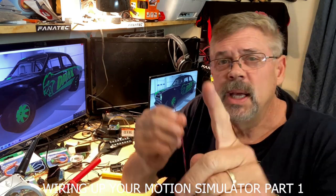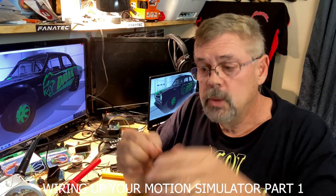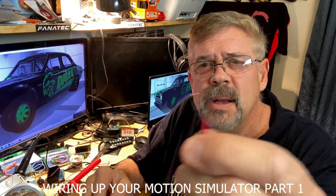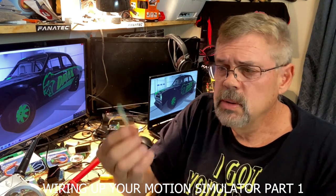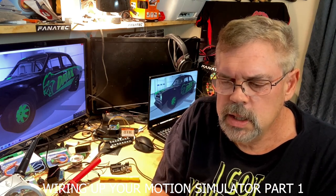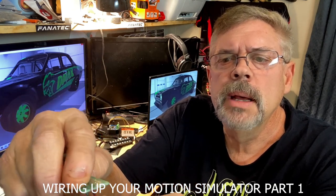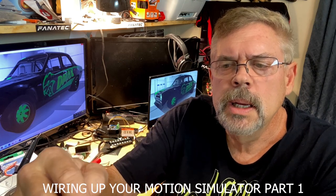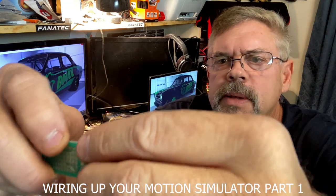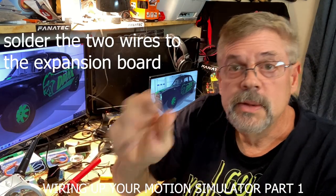I got two of them done. Try to keep your hands clean — if you've got a bunch of grease, try to wash your hands at least. We just want a little bit off of each end. We're going to poke it through here. The black wire — put it on one side. I'm poking it through and I'm just going to bend it down. And the red, I'm going to do the same thing — just poke it through and bend it down. So we've got this kind of thing going on. We're going to go ahead and solder these down just to keep it nice and still.